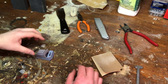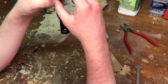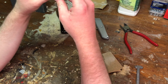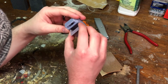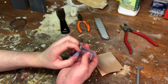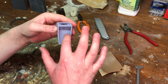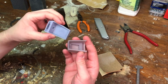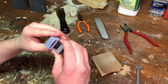That's what's weird about 3D printing — some things work, some things don't. You're going to experiment a little bit. This one is the big concern for me but the solution is actually pretty easy. The way this goes together is it goes in the end here, but you can see it toed out just a little bit. If I didn't really care I could probably just squeeze it together, but that's going to have built-up stresses inside and I don't want it to crack later. So I'm going to just hit the inner edge of this a little bit and the outer edge a little bit and see if I can get it to go together pretty easily.